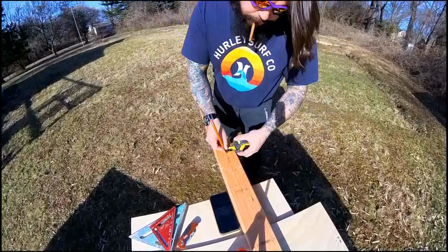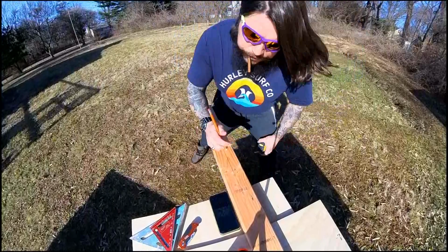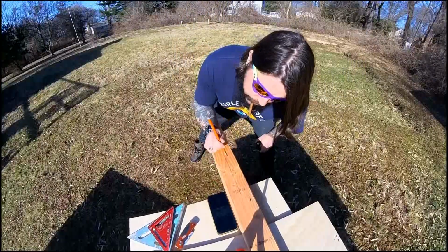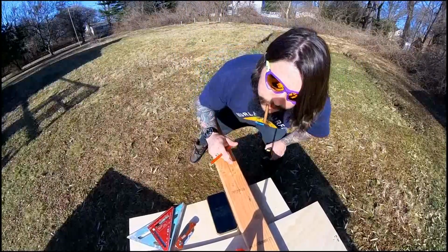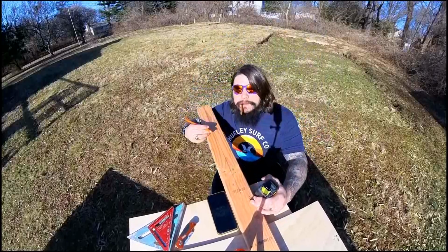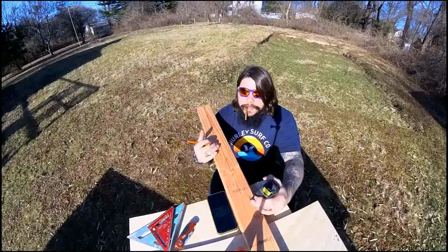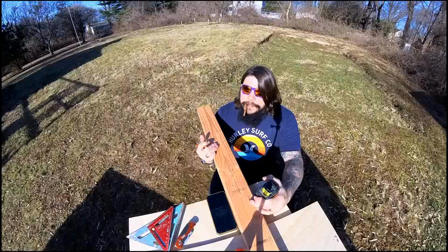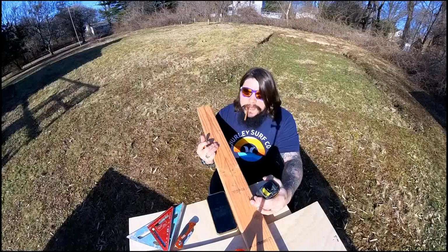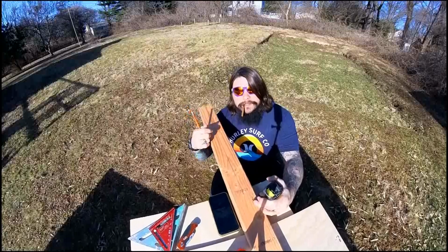See? Glide it across. Now this is if you don't have a table saw on the job, and you just got a power saw. But doing a cut like this, you really gotta have some experience under that belt. You know what I mean? You don't want to just try and do a cut like this if you don't really do a lot of cuts. Get a table saw. Go get one, okay? Otherwise, if you know what you're doing and you're good with the power saw, you practice, you cut a couple pieces of wood, you cut a couple things you didn't know you could cut, and you made it through all those battles, then you know you can handle this. Just make sure you put something underneath. You don't want to cut into your horses.